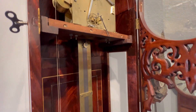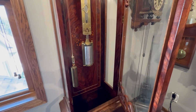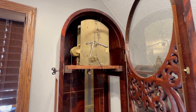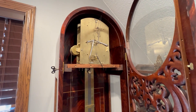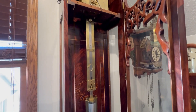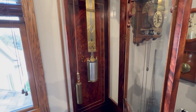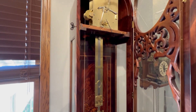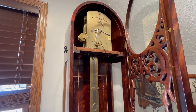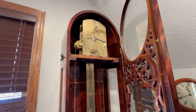I've just got this together. It's been running only intermittently as I've been playing with it, but I'm going to leave the dial off and just let it run for a while and see if it's reliable. This is somewhat sensitive to being in beat as all deadbeat clocks are, but it's running at the moment. So if this runs well for 24 hours or so, I'll go put the dial on and I'll continue to live with it. And then that will inform what additional work I do to this clock. Thanks for watching.